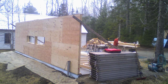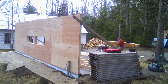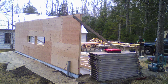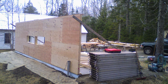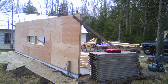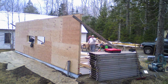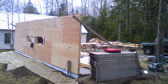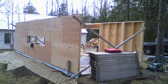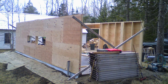The east wall has a large header which they're forming up here. You can see Josh is working on that, and he's putting insulation there again to thermally isolate it from the exterior. Now this wall is quite a bit heavier because of that door header — we have that large sliding glass door on the east side, so they need a couple more guys to help tilt this one into place. The single top plates and advanced framing techniques are not standard but are becoming more widely adopted.